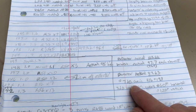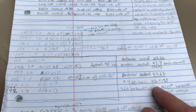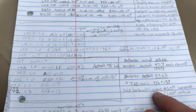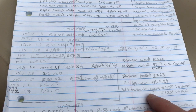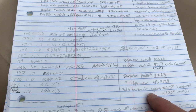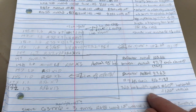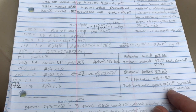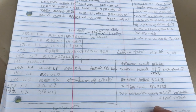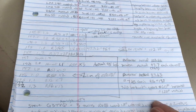It's supposed to have 7 dB gain — again, this isn't the high-gain version. Front-to-back ratio of 19.9. I have tested that and it does work. I can't say it's exactly 19.9, but there definitely is a front-to-back ratio. The 3 dB beamwidth is about 60 degrees horizontal azimuth and about 120 degrees vertical, so it's got a lot of up and down.